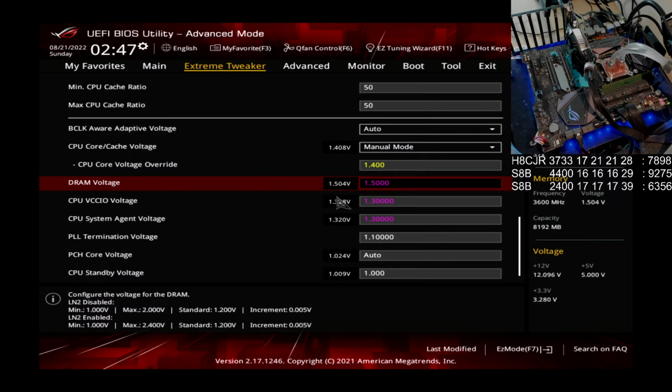So that's what we're running, which is also not too bad for an OEM B-die, because again, OEM sticks usually stop scaling pretty early, and 1.5 is not all that early. But I don't really know how it compares. I've seen other people run like 1.45. I think I've actually seen people run more than 1.5, but that doesn't specifically mean it scales all the way to that. But it scales to 1.5 volts, which is better than what it could have been.